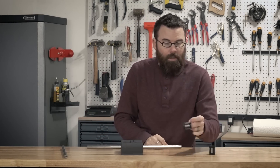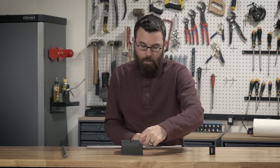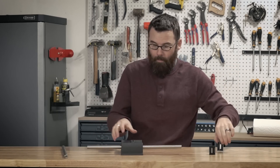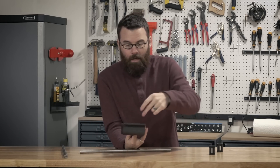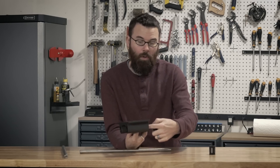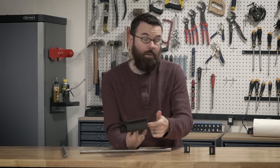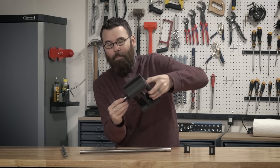Typically bearings like this are meant to go inside a bore and then you have some sort of slot on the inside of that bore and then there's a snap ring that holds them from coming out. This particular bearing block has a couple of posts set inside and they keep the bearings from going all the way in, so you can see it's stopping right there. I just need something to keep them from coming out.